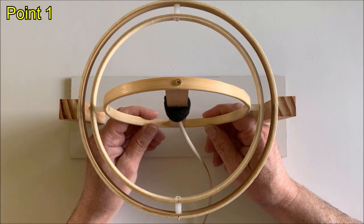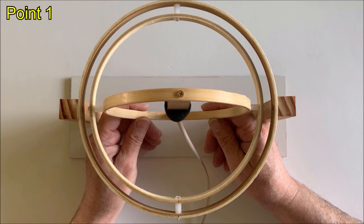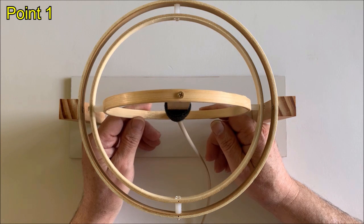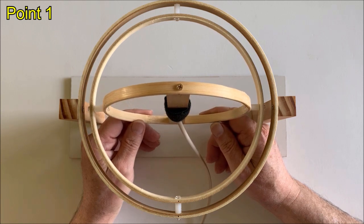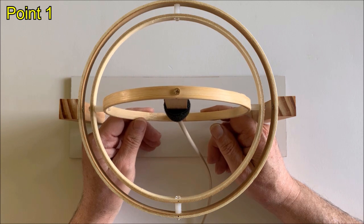We then point the front side of the sensor vertically. We search around that point until SARCTRAC stops beeping. Due to heavy filtering while calibration is in process, the data takes a few seconds to settle at each point. Whenever we hear another beep, we stop and concentrate around that point. This is point number one complete.